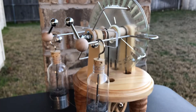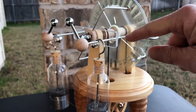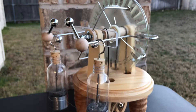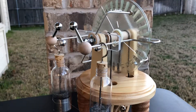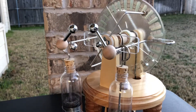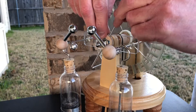Insulation on the interior of the jars isn't that important because you don't have corona leakage in there. If you had steel wool on the outside — on the charged collectors and the metal that goes to the output terminals — the steel wool would leak a tremendous amount of charge into the air. Inside the jars it doesn't appear to significantly affect performance, and it's just so much easier. However, steel wool can catch fire — that's always worth keeping in mind. I've had it happen with Wimshurst machines before; with limited oxygen the fire goes out quickly, but it is worth noting.